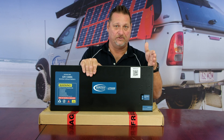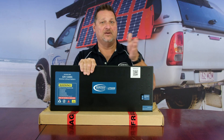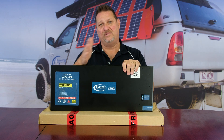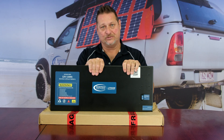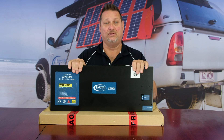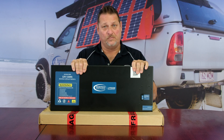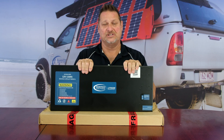It also shuts the battery down at zero degrees C, but only when charging. You can still use the battery down to below minus 20 degrees to pull power out of it — you just can't put charge back into it until it gets above ambient zero degrees temperature. Generally, anywhere between zero and five degrees, the BMS will reactivate and allow charge through. That's a safety device so you don't have something virtually frozen inside and then shock it with a heap of current and voltage — it's like pouring boiling hot water onto an icy windscreen. Yes, it'll melt the ice, but it'll more than likely crack the windscreen because you're taking it from one extreme to the next too quickly.